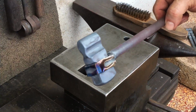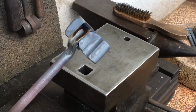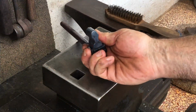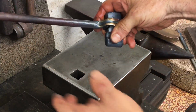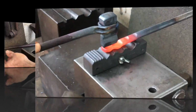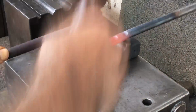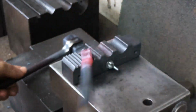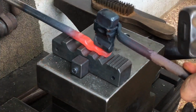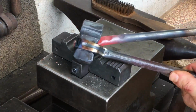So I touched the outside of the wrapped part with a flap disc while it still had some residual heat. I think the way the handle is inline but slightly offset to the left is going to be perfect for me. I can sight this tool much more easily, and the harder D2 steel makes it move material much better.